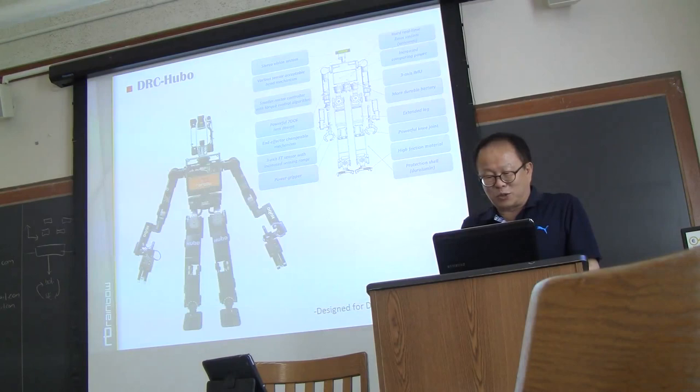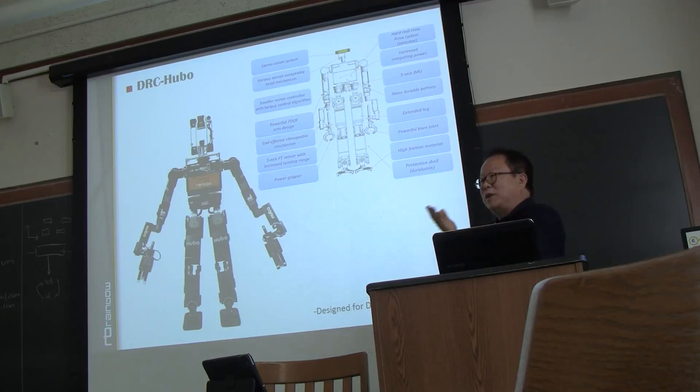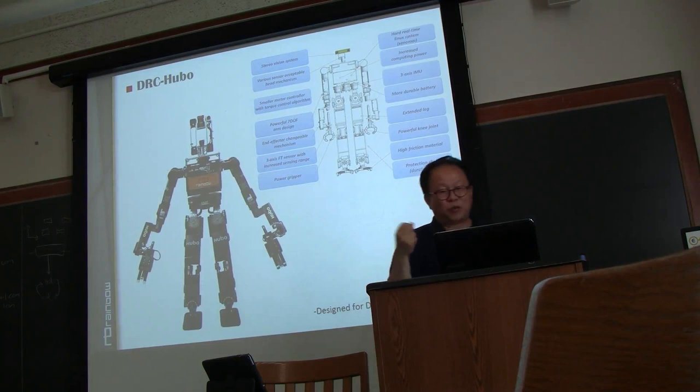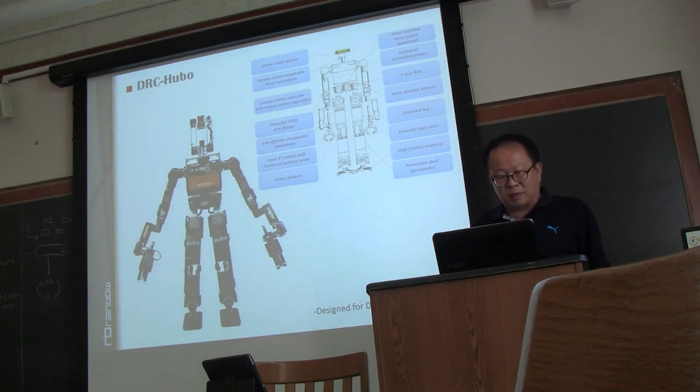So based upon that design, we completely redesigned the robot for the DARPA challenge. As Chris Hauser briefly explained, we extended the leg length about 20 centimeters and the arm length by more than 10 centimeters to reach further. We also have a transformable hand unit for quadruped walking or some kind of point rotating for this part, and the other part has a 3-finger or 4-finger hand. And the vision head has LiDAR, stereo vision, and mono vision, etc.